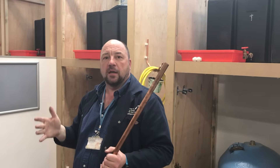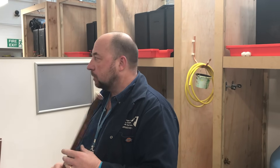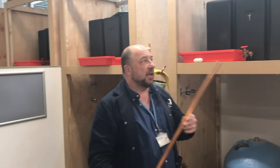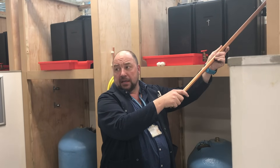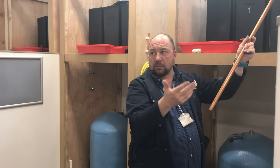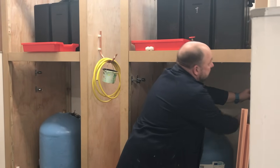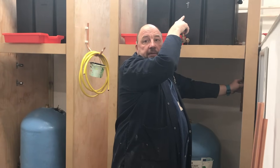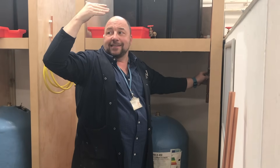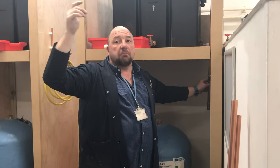The airing cupboard — tasks C1 and C2. C1 is about connecting the cold water storage tank, but C2 is connecting everything else. We've obviously got the clips in position here, but to get that centre to centre accurately — if you just did a centre up to the wall, you'd have to work out how much from the wall back to the centre of the pipe, which becomes troublesome. So if you've got a piece of pipe already in the brackets, located up there and fixed, you can now make the centre-to-centre bend a lot more accurately. You can only get that centre to centre once the cold feed has been connected, because the tank will move.